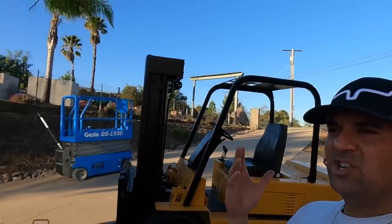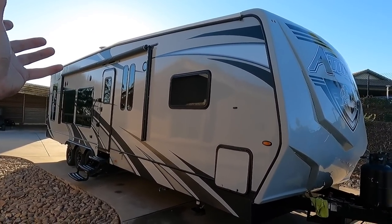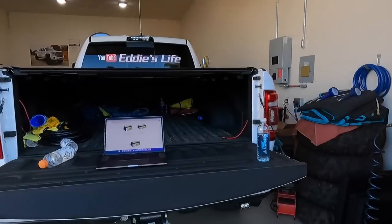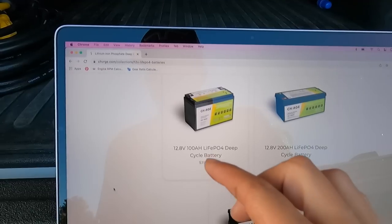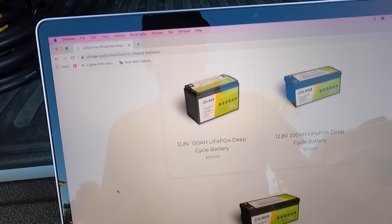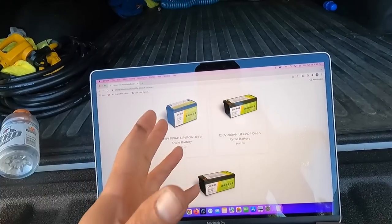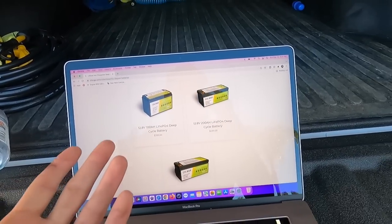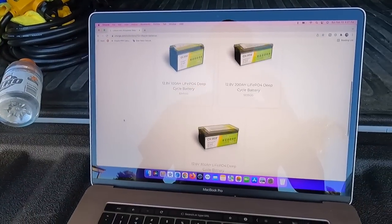The issue is you need a massive amount of solar panel to replenish the batteries, so I've chosen to go with a bigger battery bank. Pricing: a regular 12-volt 100 amp hour is $400 — not that expensive, since a deep cycle 6-volt is like $250. These lithium batteries have ten times better technology, last much longer, and have no Peukert's loss, so you get 100% power whether it's at 100% or 1%.